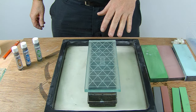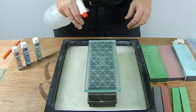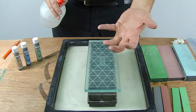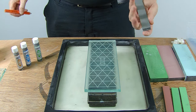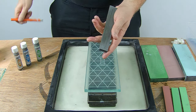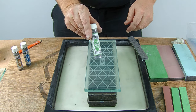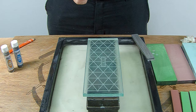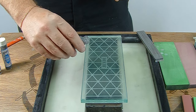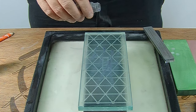So we're going to demonstrate using the powders on 1x6 stones. What we do to get started is just spritz it with a little bit of water. You can run it under water and just have it wet — you don't need a pooling of water. I've got pre-soaked stones, so I've got a 5k. I'm going to mark it with a pencil. I'm going to use the fine grit because it's a 5k, so it's a fine grit stone. You don't need a whole lot, especially for 1x6s — just a little bit, like a pepper.